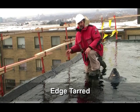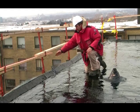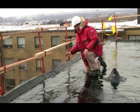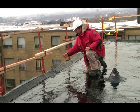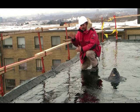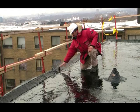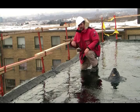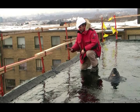Here is a typical edge on a roof — what's called a canted edge — which goes up and over. Other types include a parapet wall edge where you take material up the wall and a secondary material goes up and over before putting the metal on. What we do is take two plies in the field area and two plies of edge detail material — either modified bitumen or polyester reinforcement — up and over the edge. We've found that if you don't go over the edge and a sewer backup fills the roof with water, water can get in behind it. By taking it up and over and nailing the edge down before putting the metal on, water falls to the outside of the building and cannot get inside.